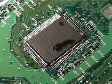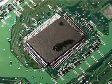Press each pin to see if it's soldered on good. If it was like the one we had at the beginning, it would move. Give it some nice pressure so you can tell if the pin moves. This side's good — we don't have any bridges and we don't have any loose pins. Just do this for all four sides, and that's it. Simple as that.